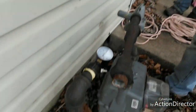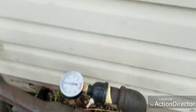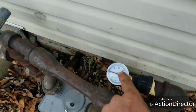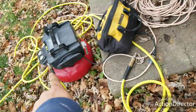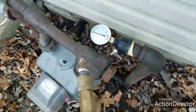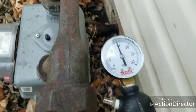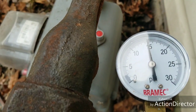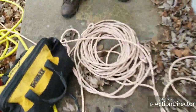Hey, what's happening. Today we want to do a pressure test on a gas line — suppose we have a leak so they won't turn the gas on. We took this apart with a pipe wrench, put a pressure tester on there, ran off a little air compressor. We filled it up to 15 PSI; that's been about six minutes ago and it dropped down to 14, so we got a leak.